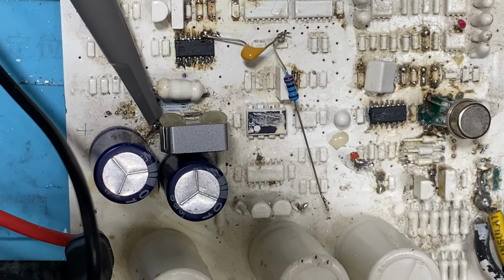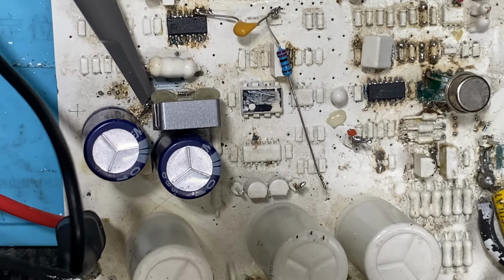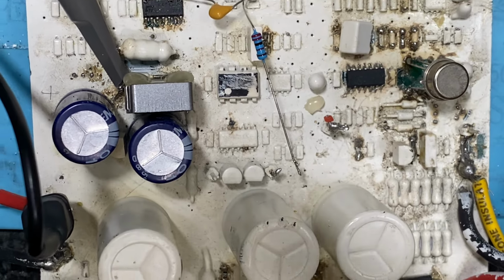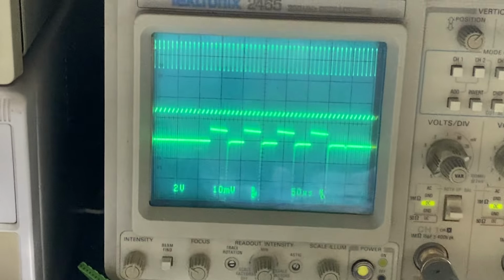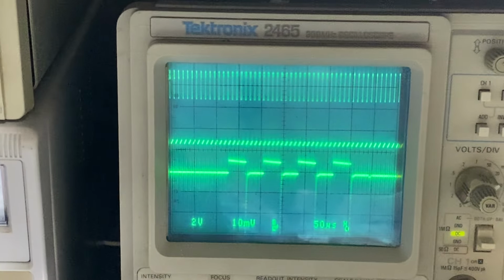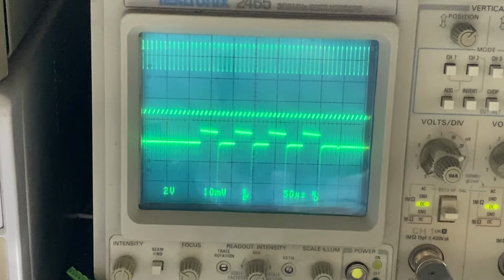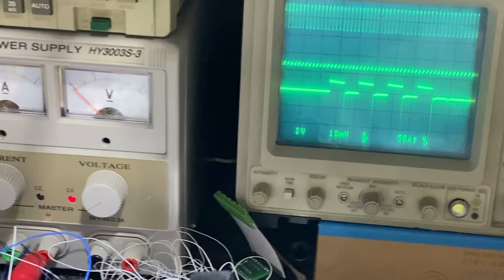So what we're going to do here is connect the end of that 22K resistor to where that solder is sitting on that test point. And what I'll do, you can see here that the switch mode's running, and it's running straight through the receive windows of the poor old detector. So what I'm going to do is turn this little handheld thing into tripod mode.